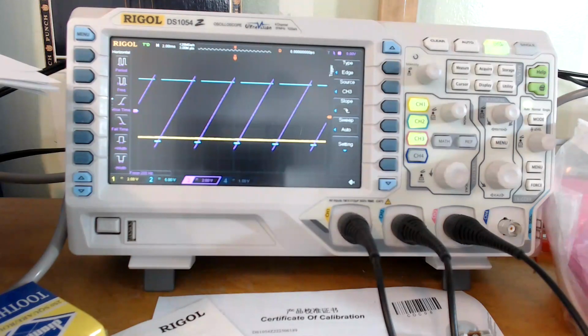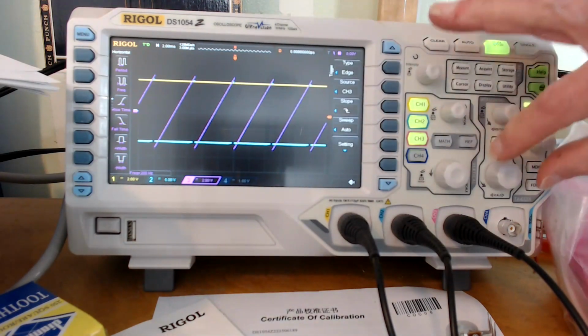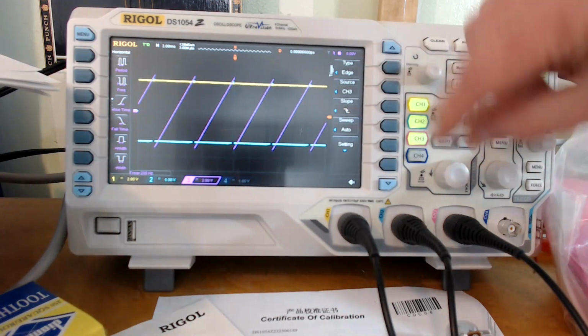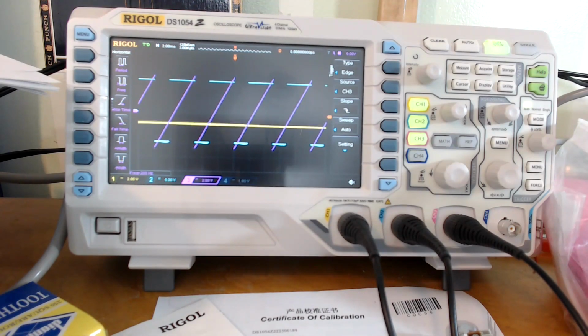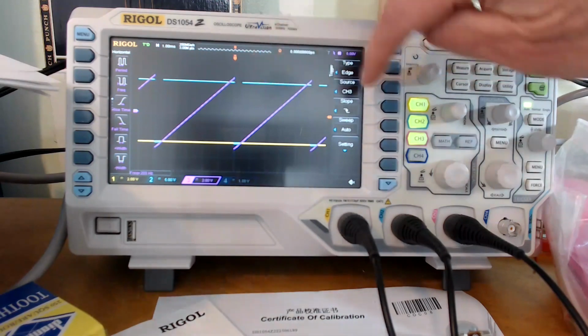If I switch over to the 10 meg resistor, now when I try to go to the smallest pulse width, I hit the limit of the pot, and we've still got a pulse here. It doesn't shut down before I run to the limit of the pot. And so that is the minimum pulse width we get. And if I try to maximize the pulse width, then I hit the pot limit and we've still got a pulse there, so that's the maximum pulse width I've got.